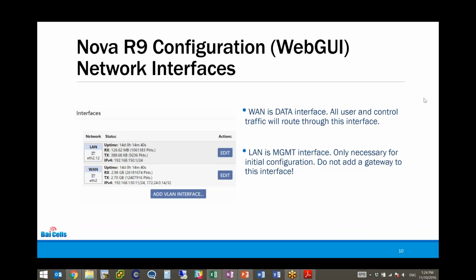If they're synced up, they should all be talking and listening at the exact same time. So yes, that does reduce a lot of interference, and that's really why you want to sync it up. But there's still going to be, for example, if you have overlaps using the same frequency, a subscriber is going to have interference from both base stations. There's going to be software coming up too that works better as far as handling reuse one schemes. I don't want to get too much into that, but natively LTE does work like you're thinking, Brian, as far as TDD. But there's still going to be interference if there's overlaps.